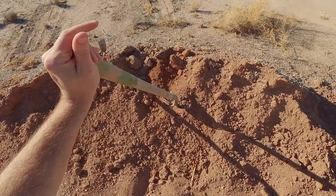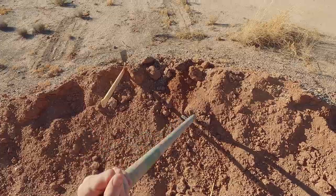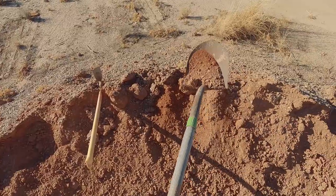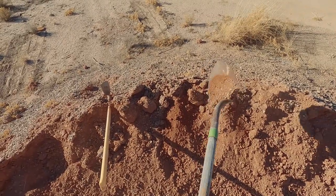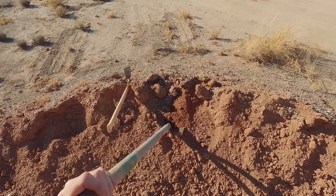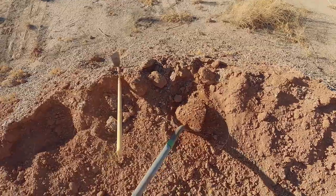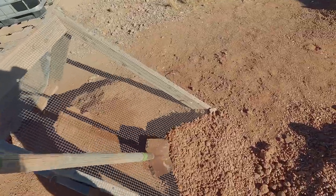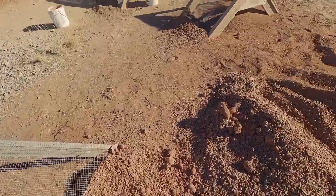Let's do a little earth engineering. We're very lucky here — there's an aggregate company just up the road that sells fill dirt which is clay-based. This stuff basically comes out of the truck as a perfect adobe mix. You could use a little bit of sand in a lot of applications, and I am going to be adding sand. It has a composition of sand, silt, and clay that is suitable for a structural wall and for finishes. There is a very wide range of earth that's suitable for construction — basically as long as you have some clay in your soil you can engineer a structural earth mix. I'm taking the dirt and throwing it onto the sifter to get out all the larger stones, gravel, and clumps of solidified dirt, giving you a nice soft pile.